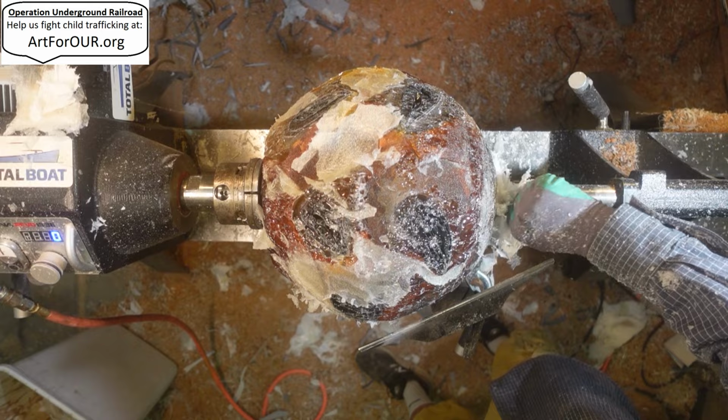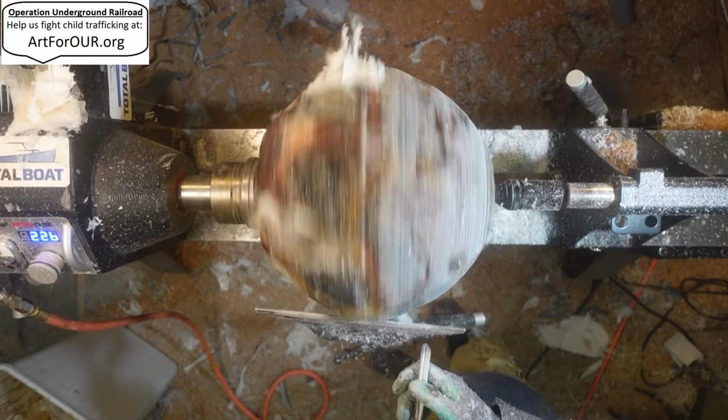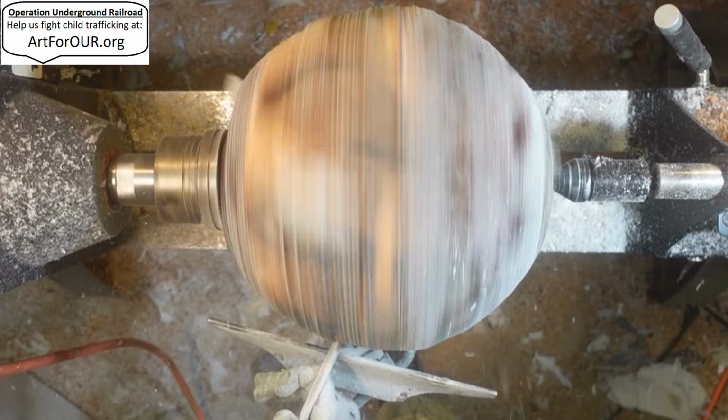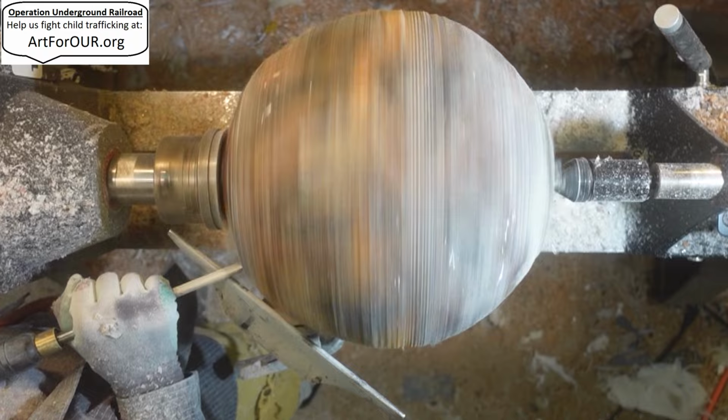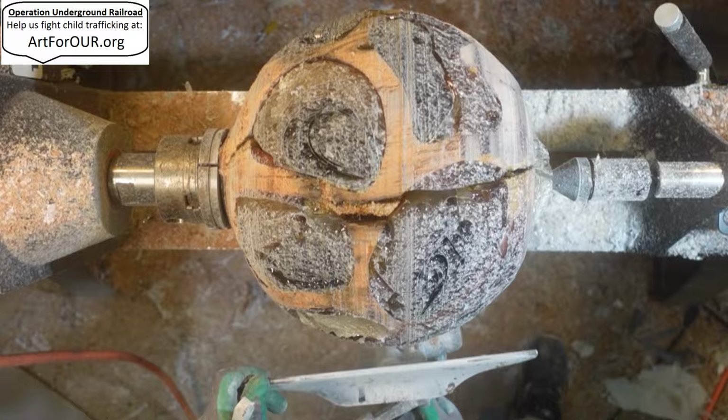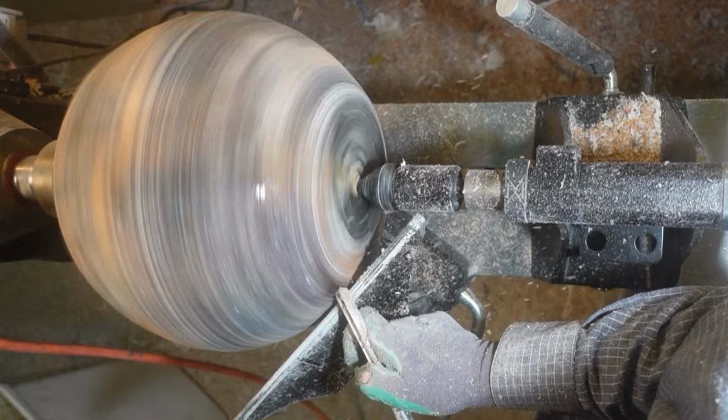One other problem that I didn't really show, because my pride wouldn't allow it, was this liner that I had, that metal liner that goes inside both the vacuum chamber and the pressure pot. I don't know why, but when this resin set, it expanded a little bit. Maybe it's because it overheated, and I could not get it out. It bowed the inside of it and it was an impossible problem. So I had to cut a slit in it to get it out, and that is no more. So, I think I have learned all the lessons I need to learn.